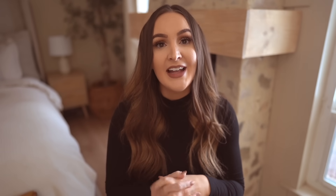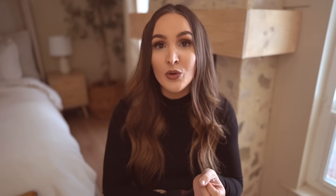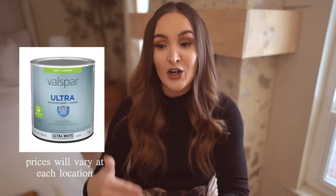My tenth tip is to add some kind of accent wall. You can do this so affordably with molding or a board and batten wall. Depending on the size of your space, you just need a few pieces of trim to really transform it, plus some paint. When it comes to paint, if you go to Lowe's and ask for the least expensive paint, they have one that's actually $16 — they don't always show it to you, but it has great coverage. We used it in a basement game room for our kids and it worked great.